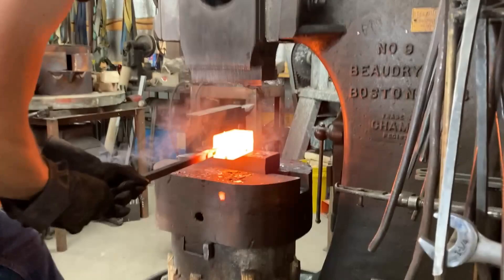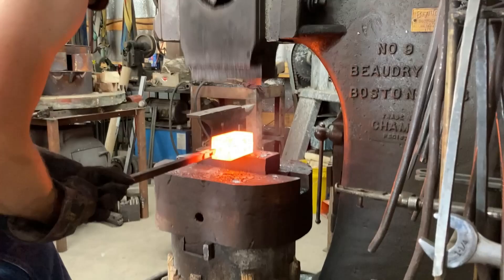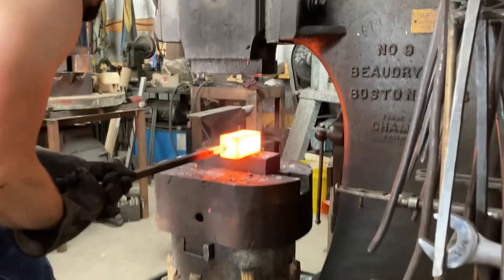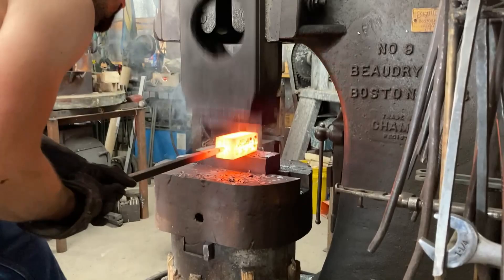When I first started mosaic work, the first few four-ways I did, I was nervous about welding in a couple directions at once — it isn't something you're used to when making the more simple bump-and-grind or coined patterns, or even the twist patterns. But just doing a few of these, you get a feel for it and they become pretty manageable, especially with a bigger hammer and some flat dies.